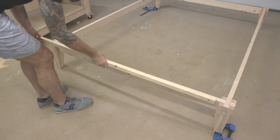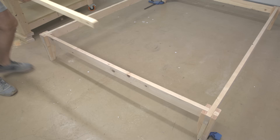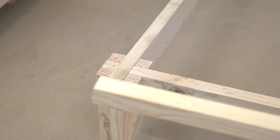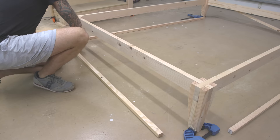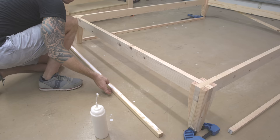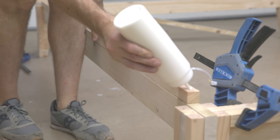Now I'm working my way around the bed cutting the ledges for the stretchers and end pieces to fit, taking my time and sneaking up on that final fit. These ledges fit right up against the legs and help add rigidity. The bed seems a little wobbly when you first put it together but becomes rigid and super strong once everything is attached. With all four ledges cut to size I glued them on and clamped them in place, flush with the top edges of the stretchers.